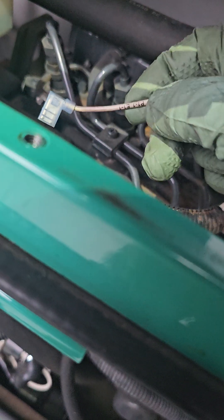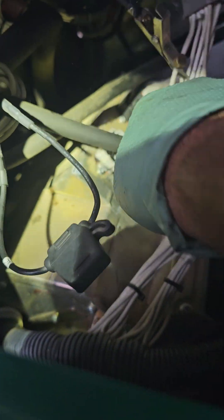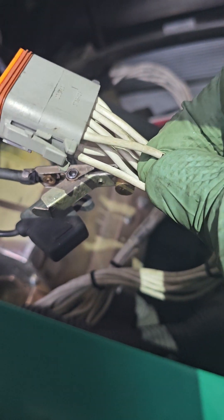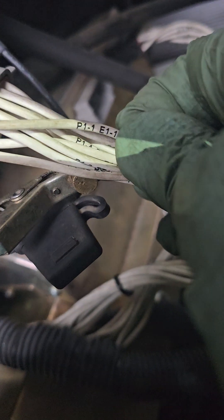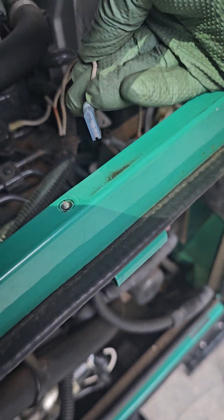Then they want you to check between the ECM — this wire comes out of the ECM. It's labeled P1-1 and E1-1; the flowchart calls it P1-1 but it's both. You check between here and the control panel, which is the gray plug, not the black plug. That's going to be the upper left terminal, which is P1-E1, same as before: P1-1, E1-1. That's connected to the blue wire here. That was a pass — they say if you don't get healthy resistance like 0.01 ohms, change the harness.